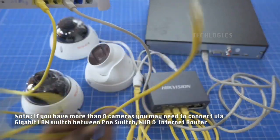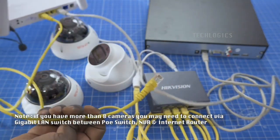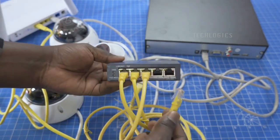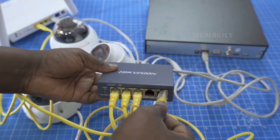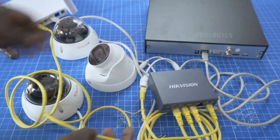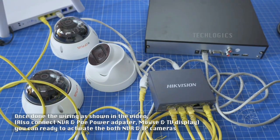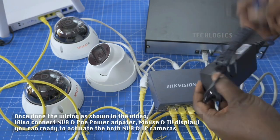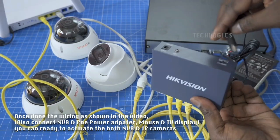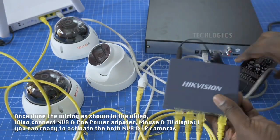The first scenario is if we connect into an existing LAN network — you just connect the NVR directly to the power over ethernet switch, and the last port goes to the existing LAN network. But in a situation where you're going to be using a router to create that network, then you have to connect the NVR directly to the router and then connect the router to the switch. That will serve as a distribution.